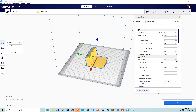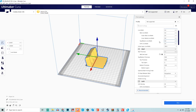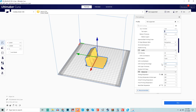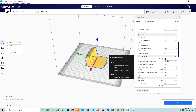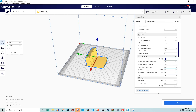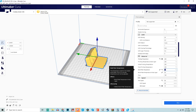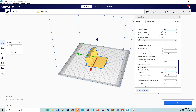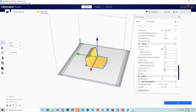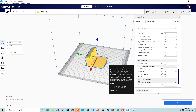Now that we've talked about the hardware, let's hop over to Cura and take a look at my slicer settings. I'm going to be printing with a 0.2 millimeter layer height and an initial layer of 0.24, which is really the standard I print with on any material. For walls, I'm running four walls and five top and bottom solid layers. Infill is 20%. As for temperatures, I'm printing at 235 degrees Celsius on the hot end and 95 degrees Celsius for the heated bed. Because this material likes to warp and is quite flexible, I'm also printing incredibly slow — 15 millimeters per second for the initial layer and all walls, and 40 millimeters per second for infill. Layer cooling is recommended and I have it set to kick on after the fourth layer, leaving it off for those first few layers to make sure the filament gets as good a bond with the build surface as possible.